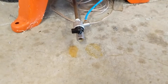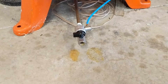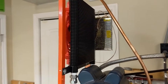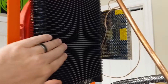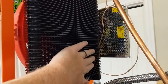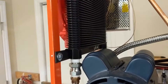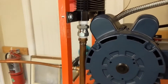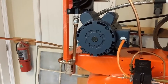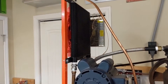The air is now completely dry. I don't have a moisture analyzer, but from what I can see of using the air, it is much drier. Once I fix some plumbing on this, this will be a thousand times better. Over on this side it's very hot — if it runs for much more than two or three minutes, I'm unable to even touch that side. But I can put my hand right here on the outlet and it's cold — this pipe is very cold. The more air you use, the colder that gets; it feels like it gets somewhere around room temperature or colder. I'm very happy with this once I fix the piping, and very happy with how this all turned out.